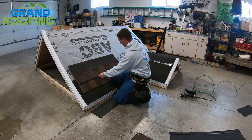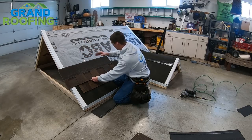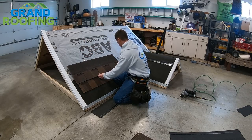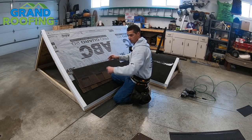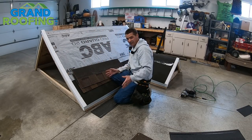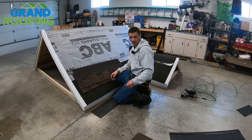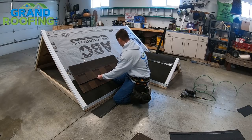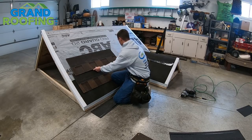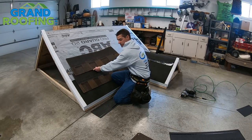Never install your shingles stacked straight up like this — you always want to offset them. Typically you'll build a pattern up to the left. I'm not a fan of racking it over in a straight line up the roof — you're going to see that pattern. It's not good. A lot of guys do it, it's just not good. I don't know that manufacturers will even honor a warranty. And when guys throw one shingle over and then the next course under it, they forget to lift the top one and shoot the shingle under it. Just not good.